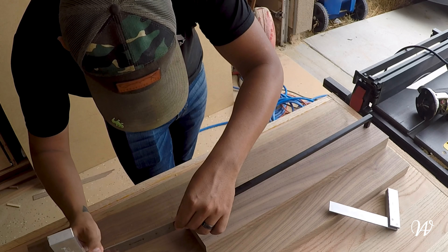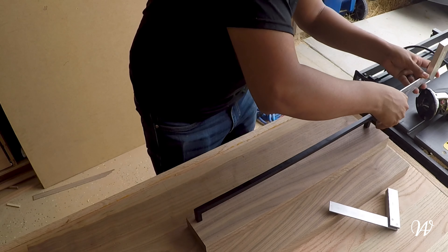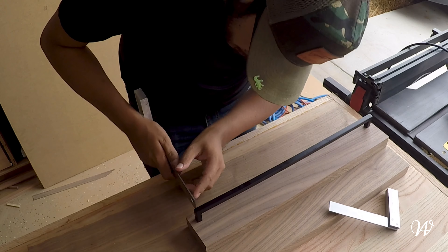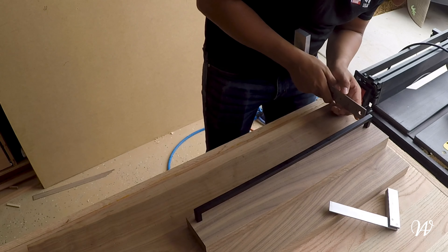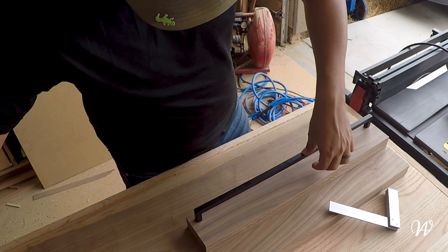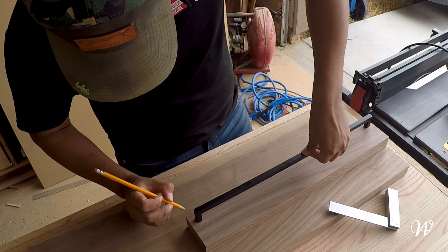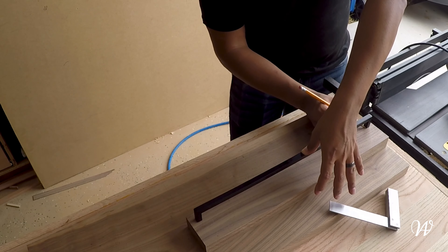For the location of the brackets, I didn't do anything too crazy. I just found equal spacing on either side and a reveal on the front that I was happy with, remembering that I needed to round over those edges still. I grabbed a pencil and just traced around where these brackets sat, then drew a line corner to corner to make a little X in each one of the boxes — right in the center was obviously the center, and that's where I drilled my holes.